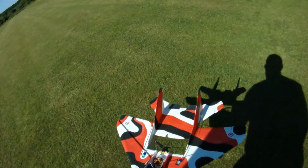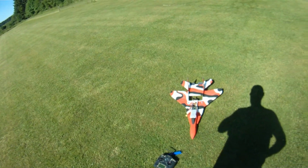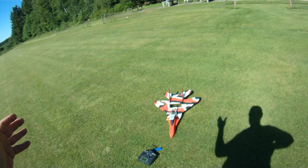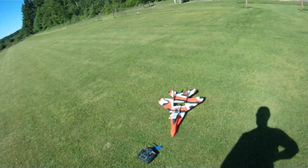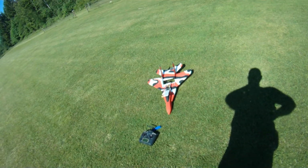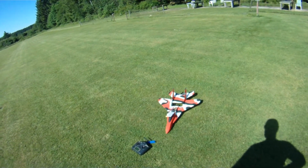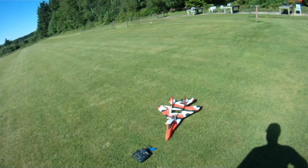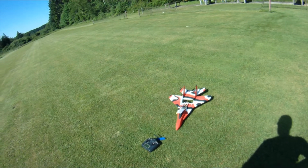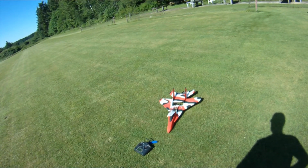When I tested this a couple years ago, I wasn't really able to find a definitive amp limit. I would estimate it's around 40. Just like we were with the Emax 2306, I think we're pushing this motor and speed controller to their limit, but there haven't been any issues, touch wood, no skipping, desyncing, sag of power, anything like that. They just keep running strong.